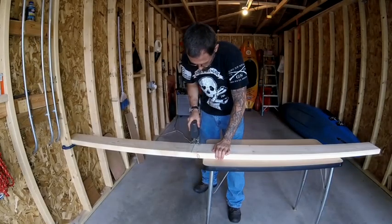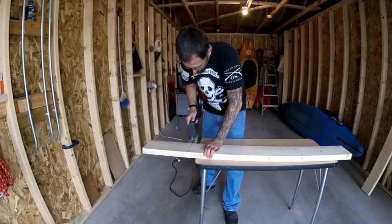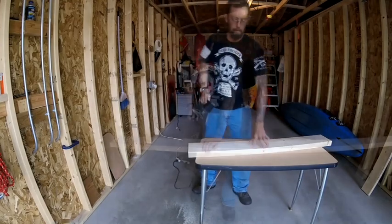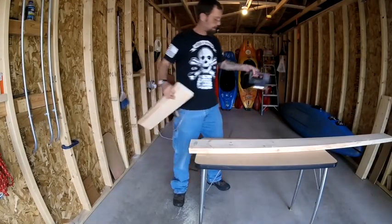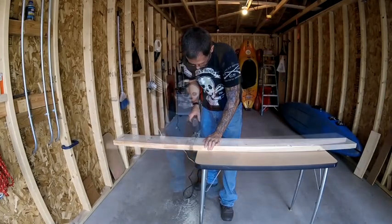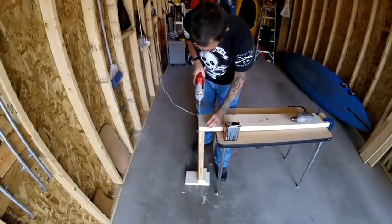To start, I'm going to cut two two-by-sixes at 42 inches each — these will run the width of the bed frame. I'm then going to cut two two-by-sixes at 24 inches each to run the length on the back half of the bed frame, and then one two-by-six at 38 and three-quarter inches that will run the inside width on the back portion for added support.